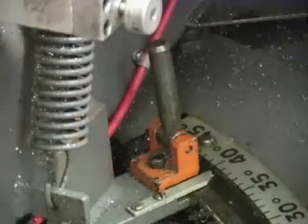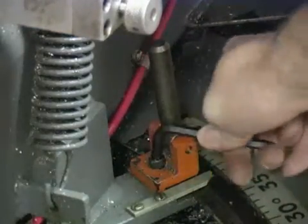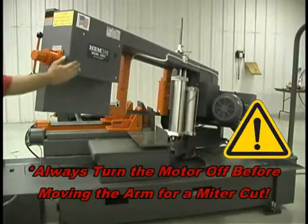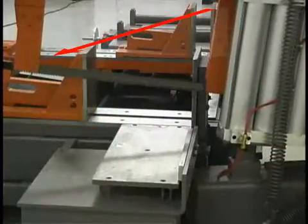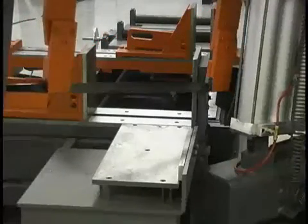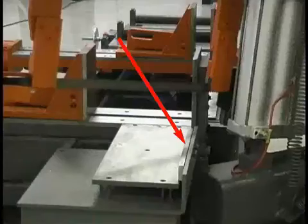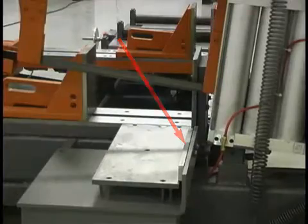If the cam lock lever is too tight to enable locking it down or too loose to adequately lock, it can be adjusted using the allen head bolt located in the cam lock lever mount. Always turn the motor off before moving the arm for a miter cut. Check the adjustable guide arm location — the arm may require opening to clear the material or the raised cutting discharge plate. Also loosen and slide the movable vertical support on the discharge plate; if this is not moved back and the arm is rotated, the vertical support will be cut along with the material.